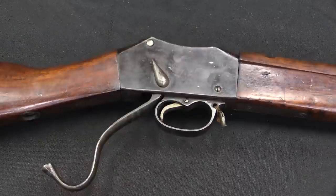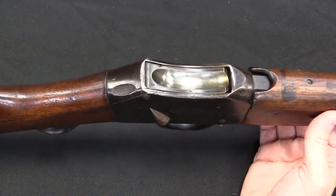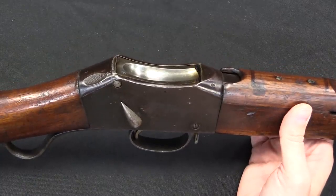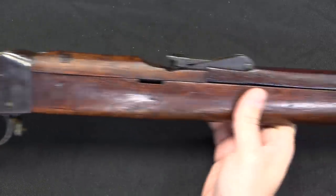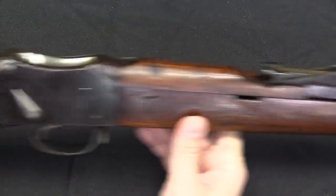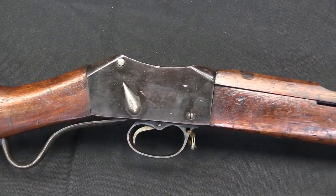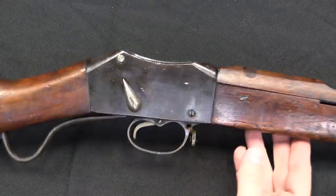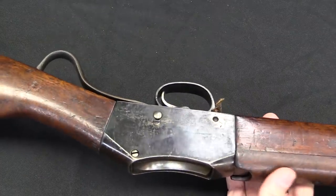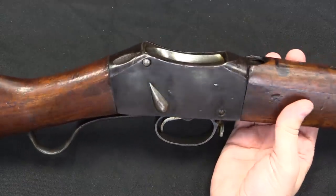One Martini action, short lever — I can pop that open. It is in .303 calibre, of course. Now, the British did actually convert a lot of Martinis to .303, and they're typically called Martini Metfords or Martini Enfields, depending on whether the .303 barrel used Enfield or Metford rifling. However, those conversions did not have this style of forend — they tended to keep the Martini Henry style of forend. First off, we would look for receiver markings; is the receiver appropriate for this sort of conversion? We kind of draw a blank here, because this receiver has been scrubbed of markings and then painted black — which could be legitimate, or it could be a good way to hide the origin of the gun. Kind of a swing and a miss there.